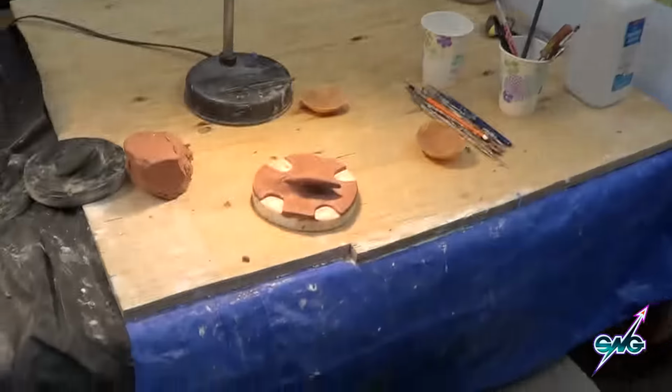Here's the one I did, and it's pretty good. It's going to be great. We're going to put a wall of clay around it and pour silicone, and then once the silicone sets up, we're going to put a wall of plastic around that and pour stone. That way, with the silicone, you use just what you need for that very area of the prosthetic. It's one piece, so there's no piece behind, because it's flexible enough that you can pull it right off. And the stone keys into the silicone, which keys into these keys, so you get a really good registration.